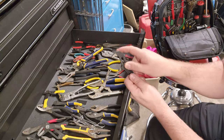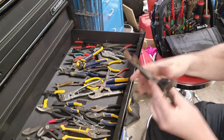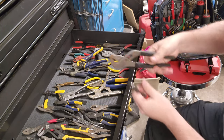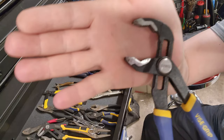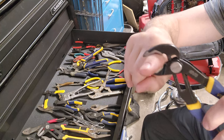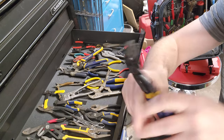One of the most important things about slip joint pliers that you should be aware of is that the teeth are almost always in one direction. Just like wrenches, there is a right way and a wrong way to use these pliers. The teeth have a direction for a reason — if I'm grabbing onto a fastener and going against the teeth I lose grip, but if I'm pressing down on the lower jaw it grips in. They're designed to be used one way, not the other.